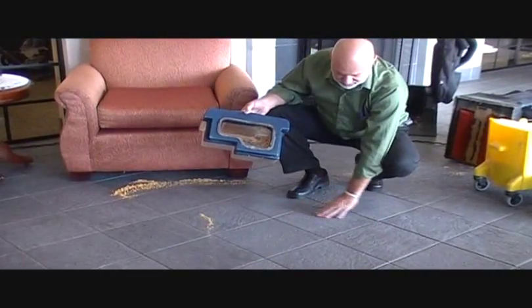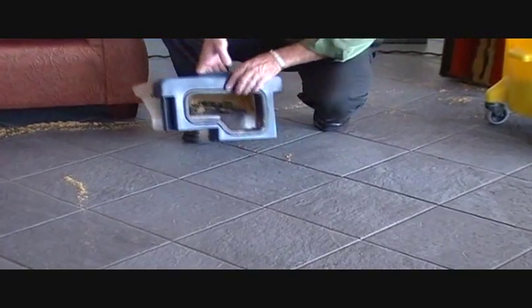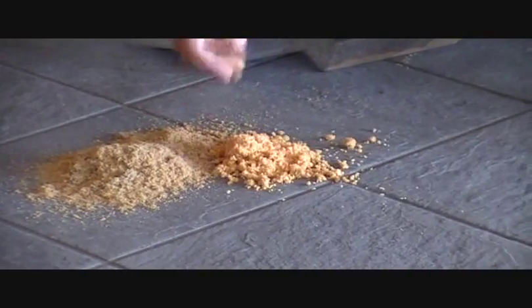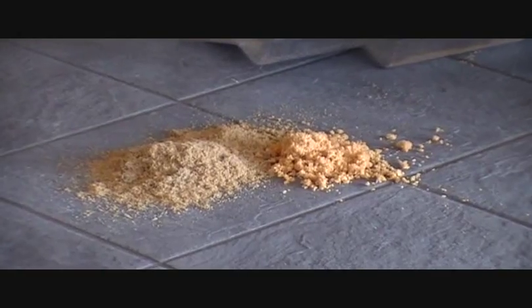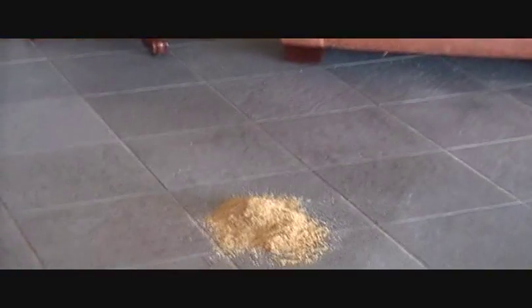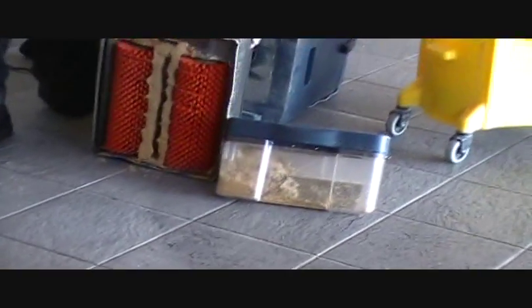What you can see here is this tile has lost the dirty brown lines that you have over here — you can see what was on the tile. In just a few seconds it picked up all of that. These are the sponges we just removed, and this is the clean sponge. What you have here is a definite transfer of the dirt and soil from the surface to the sponges. This was the pile of sponges after the first pass, and this is what's in the container now. You can see this was the outcome after two passes — the tile itself has definitely changed color.